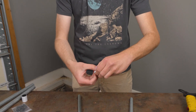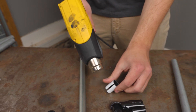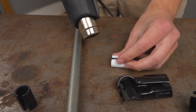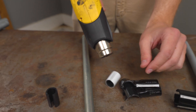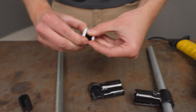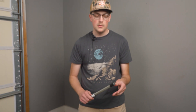If you do that and you want to make it easy to put on — this is the original one that we had the slit in — it's pretty tough to open and get around the conduit. But I found that if you get a hair dryer or a heat gun and just heat it up for a minute, let it get warm, just be careful not to burn yourself, rotate it around and evenly heat it up. When you do that, you make it much easier to open up and put over top of the half-inch conduit, and then you can connect your connector like normal over top of it. So if you're making your own, that's a hack you want to keep in mind to make it easy.